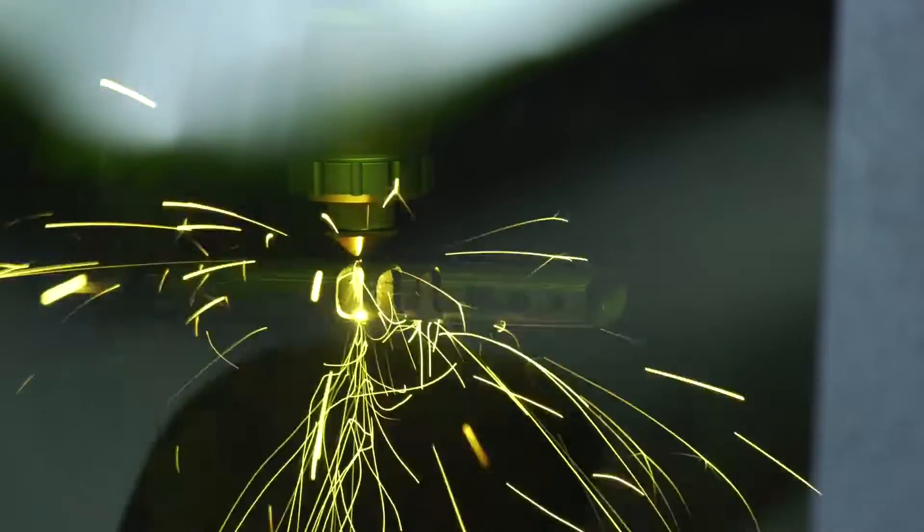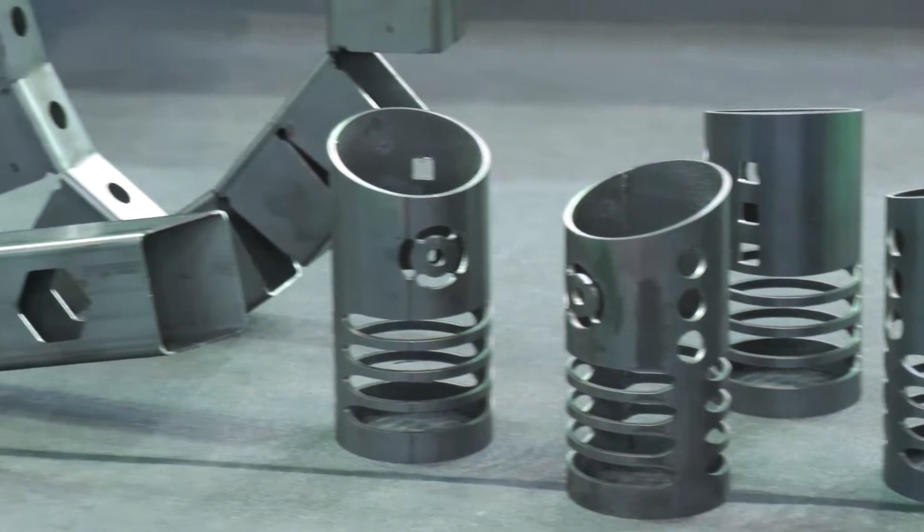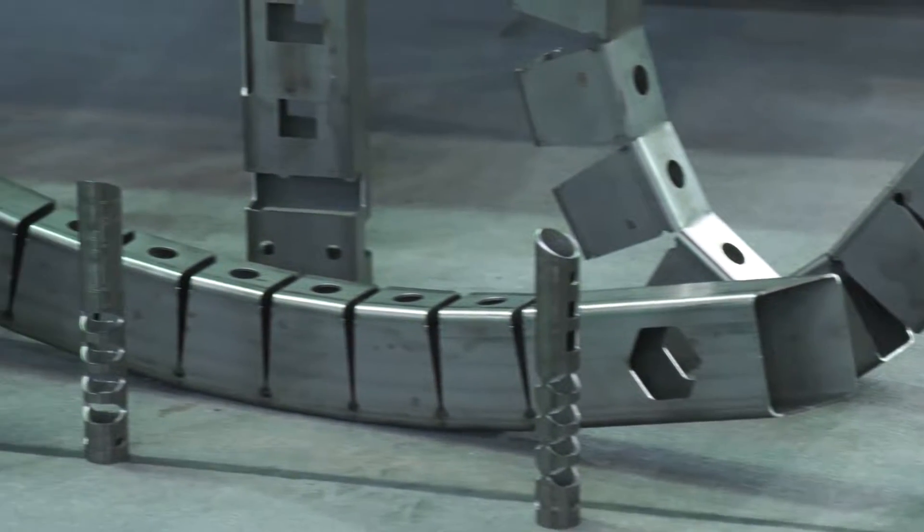If you're leaving it running you've got to have a decent laser in there, so what sort of laser have you got? This is either 1 kilowatt up to 3 kilowatt with an nLIGHT or IPG source. Nucon have developed their own cutting head, after using previous cutting heads in their R&D showroom and subcon factory, to allow engineers or customers to replace the magnifying lenses inside the cutting head with a cartridge system.